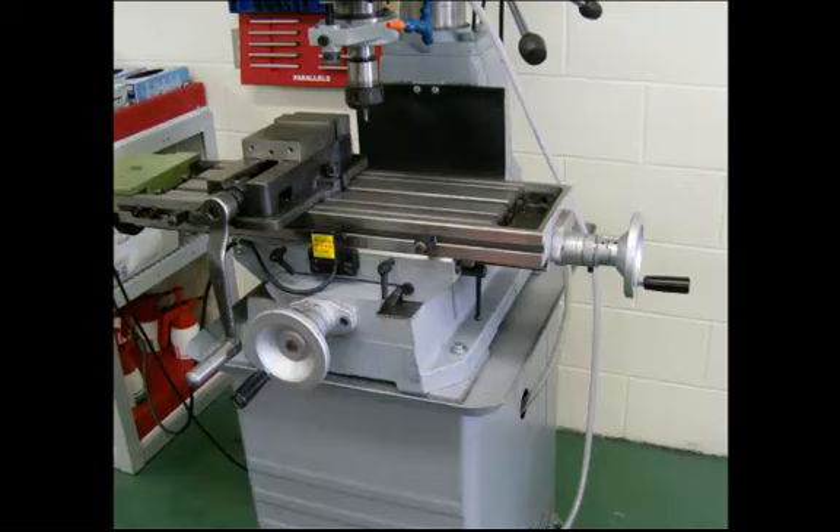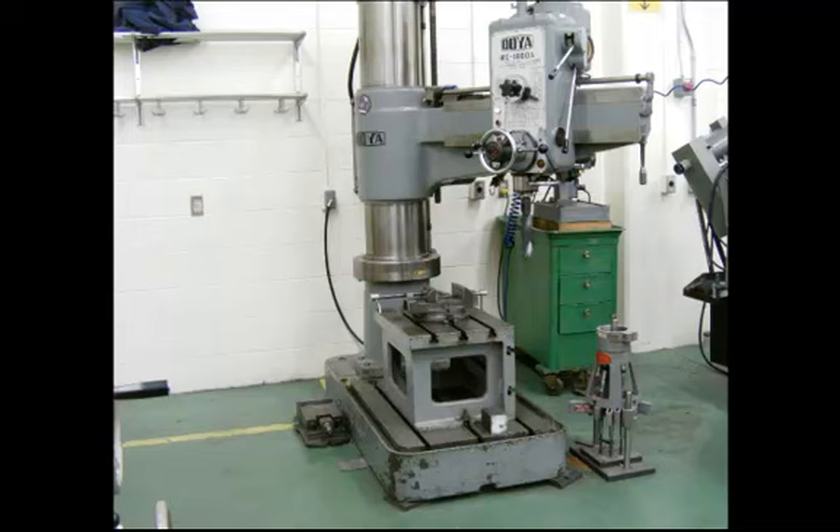Here's a closer look at the table of the mill drill. This is the large drill press that will be found in most machine shops — it's a radial arm drill press. It has a base that's hollow that will hold coolant. On top of the base there's a table. In behind the table there's a column that the radial arm will actually move up and down, swivel around the column, and it has a drilling head on the radial arm that will move in and out.